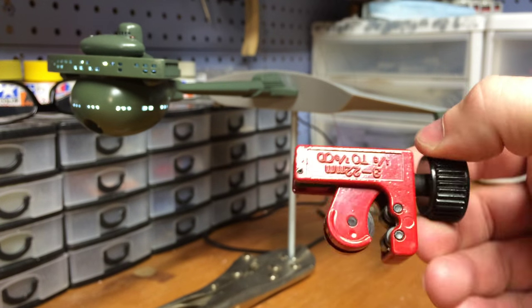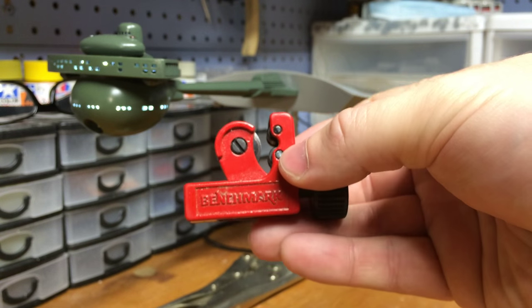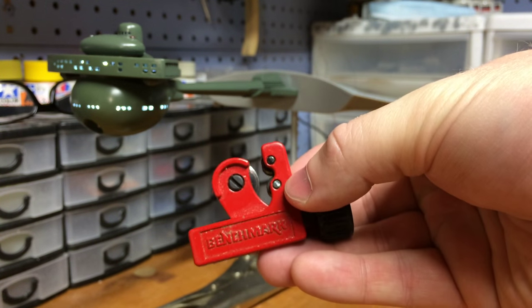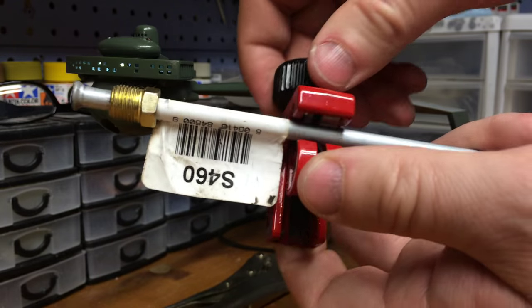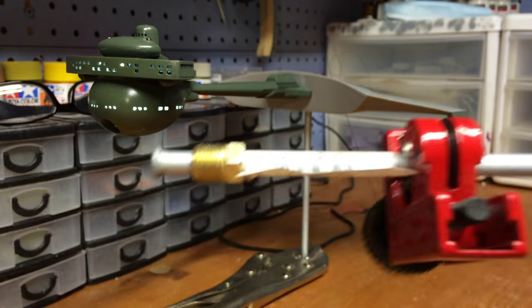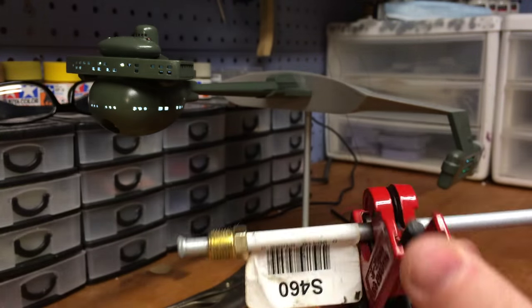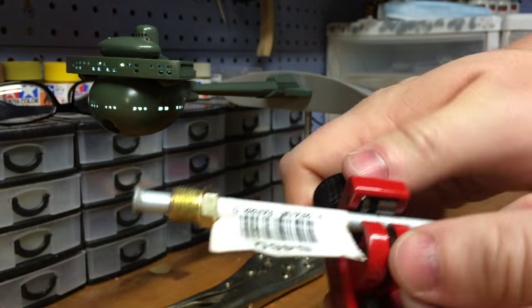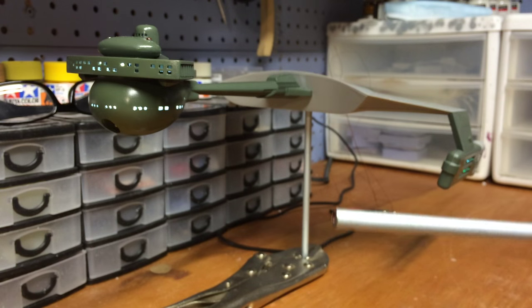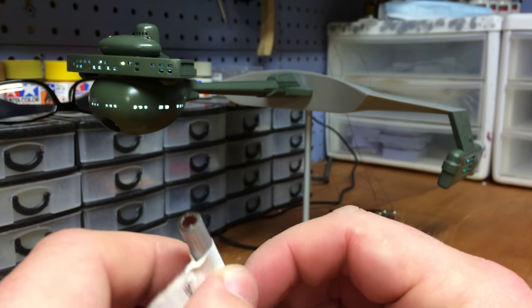You can also pick up a pipe cutter there as well for just a few bucks. I'm going to give the pipe a cut — I cut off the flared end where the nut is — and just give you a rundown on how this works. I've opened it up using the aluminum knob at the top, and there you have it — it's closed up on the rollers and there's the cutter. You just turn it, tighten it, turn it, and there you go. From there you get a nice clean cut. There's a little bit of burring but nothing a file can't take care of.